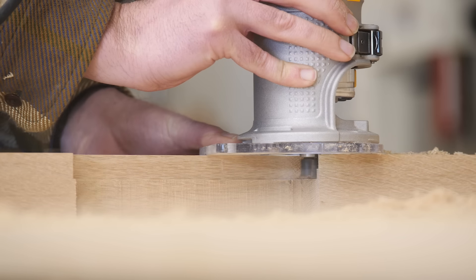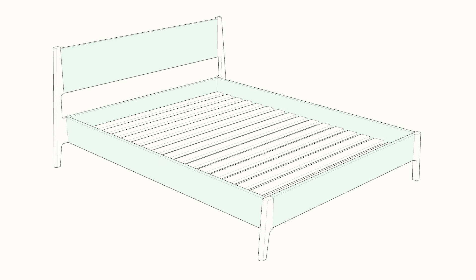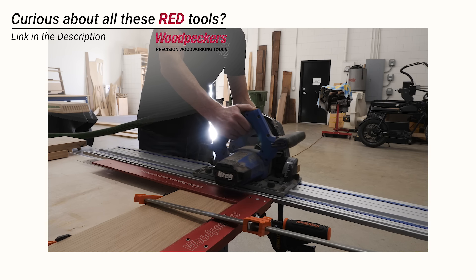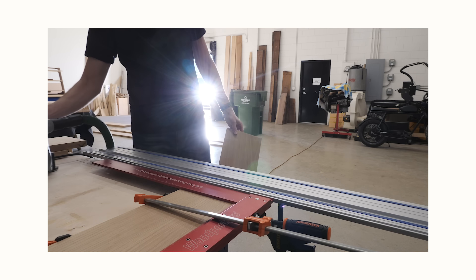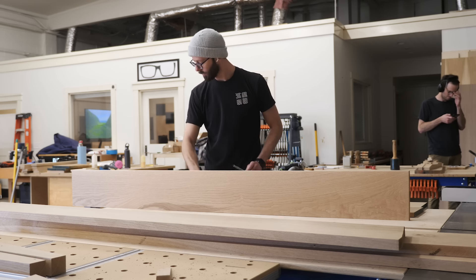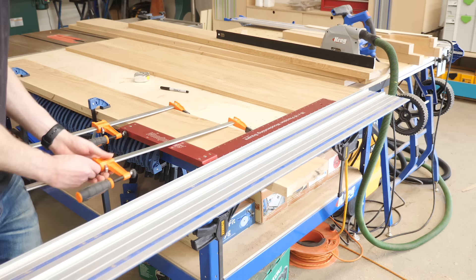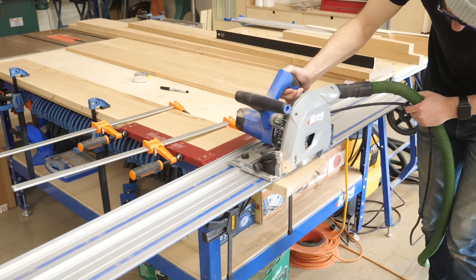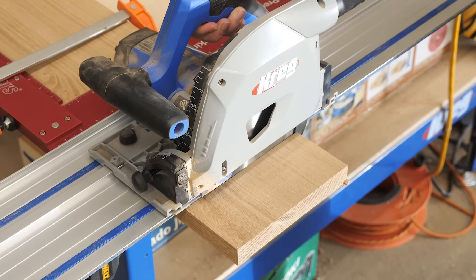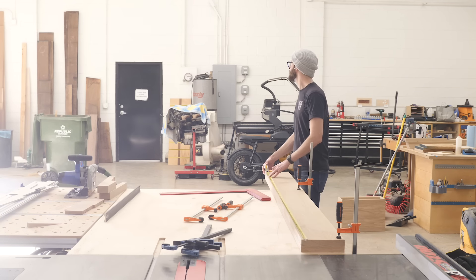At this point my headboard panel was plenty dry, so next I can start finalizing the dimensions of the rails and headboard and footboard pieces. I'm just cutting boards to length. The easiest way to cut long boards to length would probably be a nice miter saw setup, but I don't have one, so I'm going to use a track saw. To ensure they come out perfect, I find a reference edge that's nice and flat on each board, mark it with an R, and use a square to reference my track off that edge — ensuring a really good perpendicular cut. I want to make sure both rails are the same length as one another, so I cut one edge and then clamp them together in pairs and cut them at the exact same time.